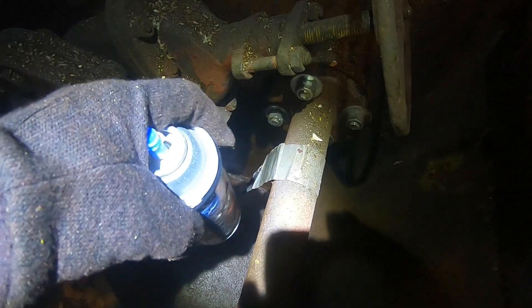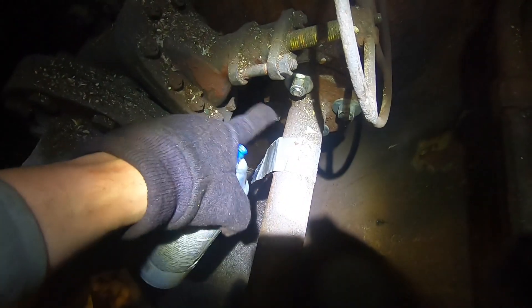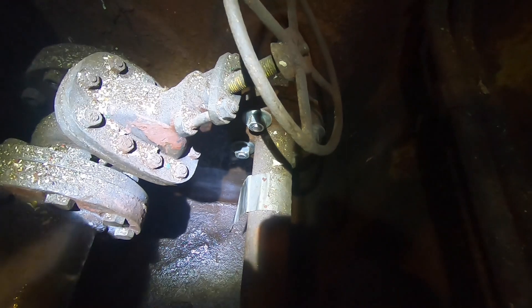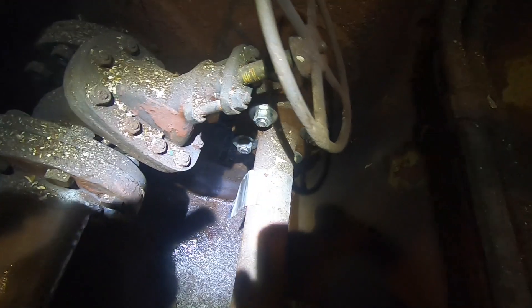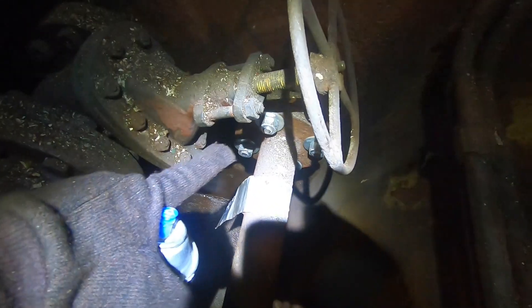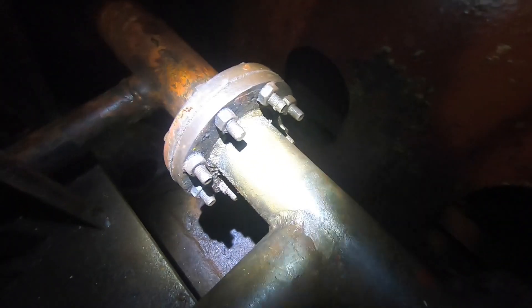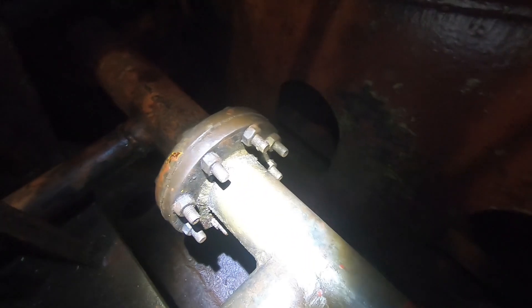This guy is actually the line that goes into the ballast fuel tanks. We found that these bolts here weren't quite as tight as they needed to be, so residual oil had actually come through wherever it could find its way out. No need to mark this because the pipe itself is fine — it was just the union here that was a little bit slack. And this is the other part of the drainage main — you can see I put a little bit of gold paint here, hoping it would be more visible.